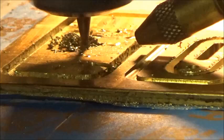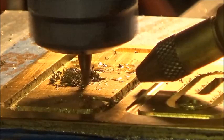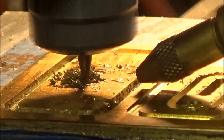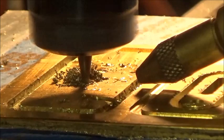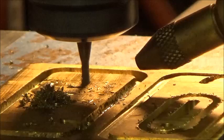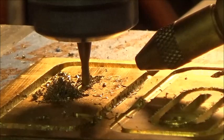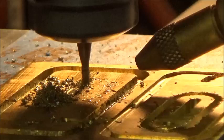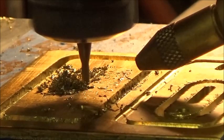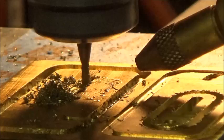I've actually successfully cut out one of the blanking pins — you can see it right beside the current work. This is the second one. The head of the mill is only fractions of an inch from the work, so it's hard to get the camera in there. What I'm also doing is trying to blow the chips out by hand. The spray mist is helping a lot and I don't foresee any problem, but this is all slot cutting so there's a lot of chip buildup. The end mill is 2 millimeters, which is about 79 thousandths — a little larger than a sixteenth of an inch.